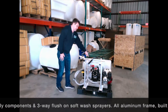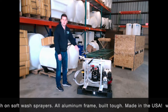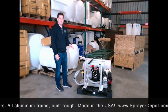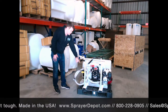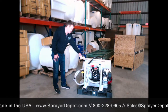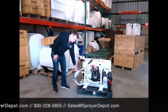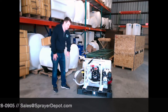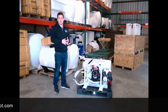If you look here, you've got poly pump, poly bulkhead, poly elbows — everything on here is poly. Poly strainer. Another big thing we do standard on all soft wash rigs is a three-way flush. Right before the strainer, you can either pull from the tank or turn the valve to flush your system. We have extra hose and there's a screen on here you can drop in a bucket of water and clean the system out. You really want to do that because you don't want that kind of chemical sitting on your pump and components.